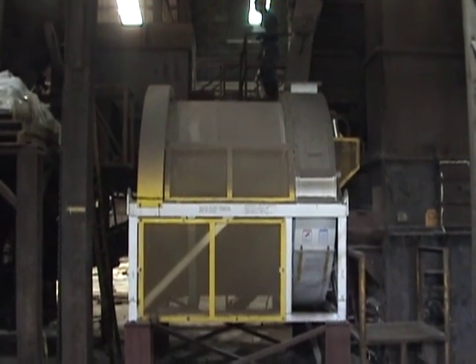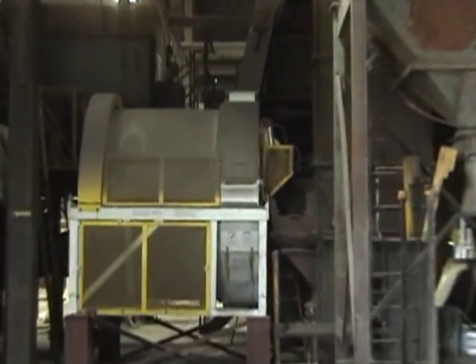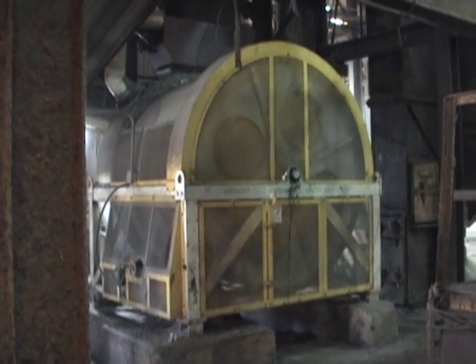The continental roller mixer has been used in fertilizer blending for over 45 years. Its design is ideal for the corrosive environment. It has only two main bearings in a drive train and the drum rotates at only 3 RPM.